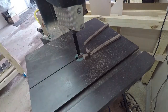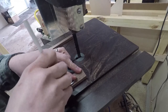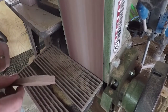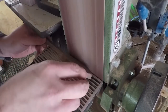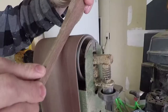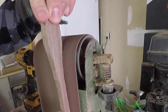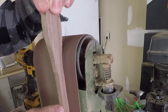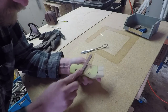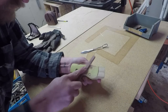I also traced the outside of the head — the ring, I guess you could call it — and cut that out off-camera. I used the belt sander to shape the body of the handle to the best of my ability. There were a couple of spots I couldn't quite reach, and since I don't have an oscillating spindle sander of any kind, I used a sanding block to get down to the line.